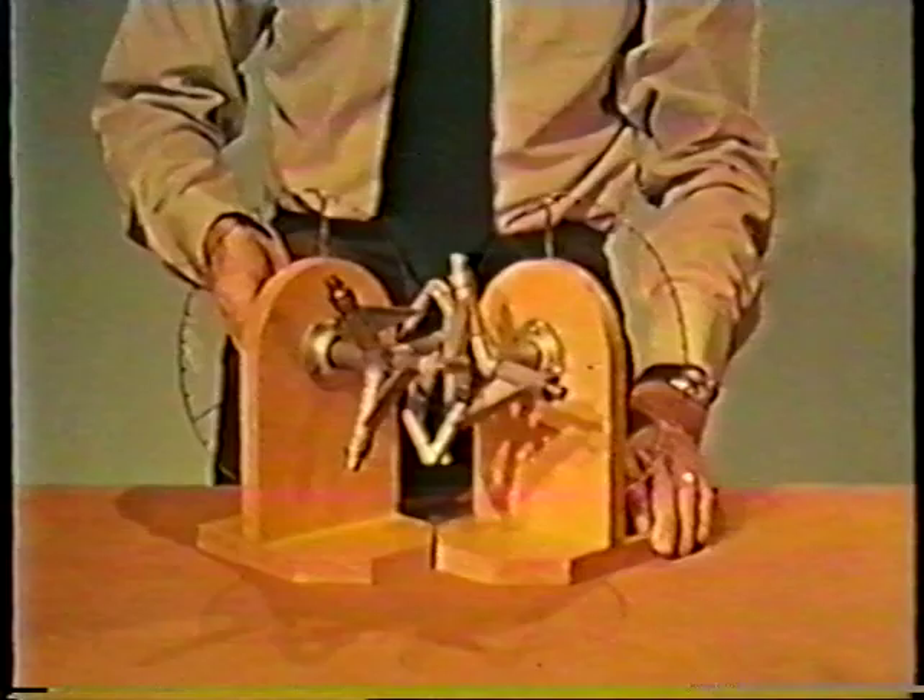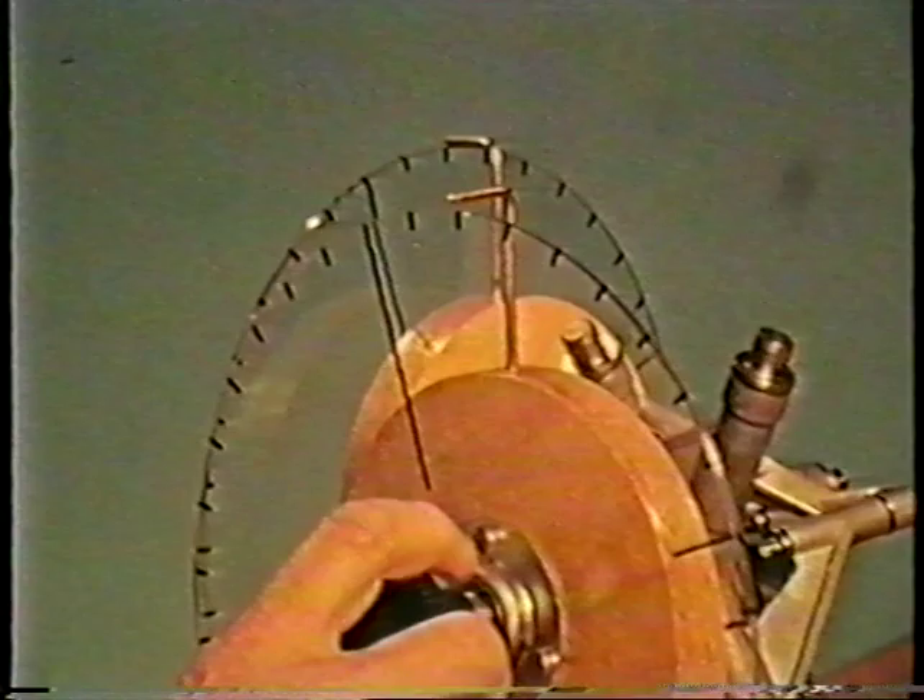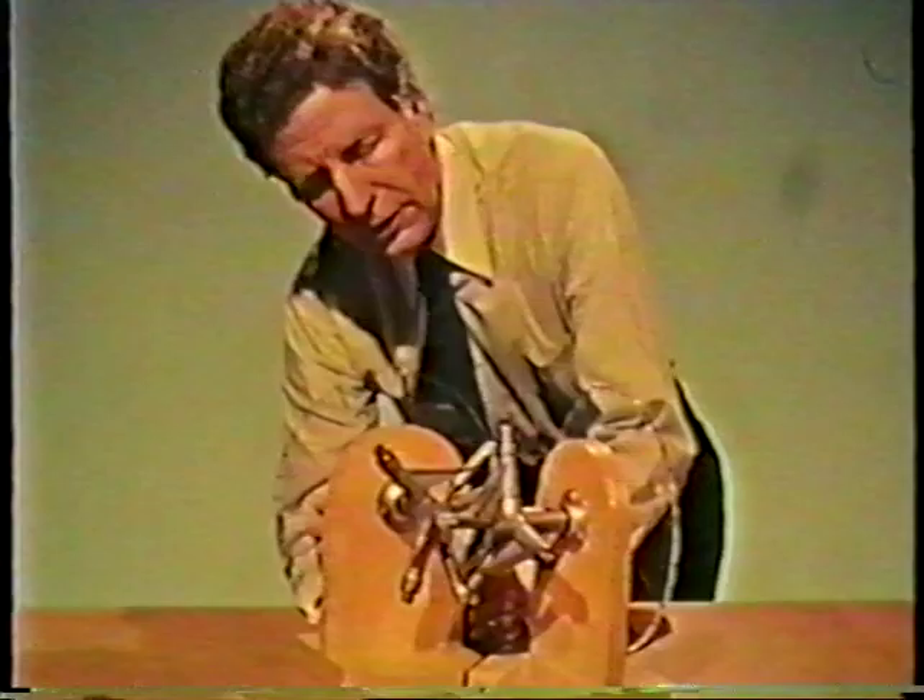This particular Uni-True model, which is a bit spidery and intended only for small torques, transmits uniform drive through a full right angle. It was designed for precision purposes with almost zero backlash. As I turn, you can judge from the dials that the transmission is uniform. But this is rather a special non-plunging coupling.